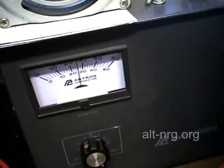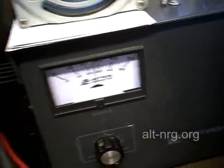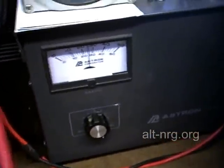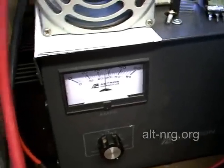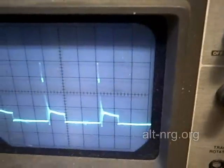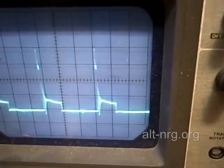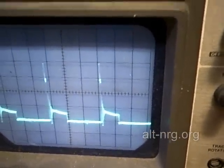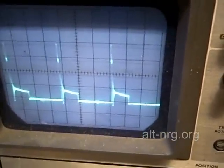And it's been running at 25 amps for about 30 minutes. No particular reason for 25 amps, I just chose that as an arbitrary value to start the production. And for the electrolyte concentration that I have, I'm going to guess that at 60% duty cycle now, it would probably want to draw a peak of about 40 to 45 amps if I were to run this straight DC.